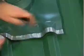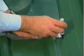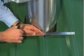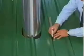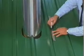After forming to the roof profile, mark all four corners in this manner. And then mark a line approximately 30mm inside this for your overlap.